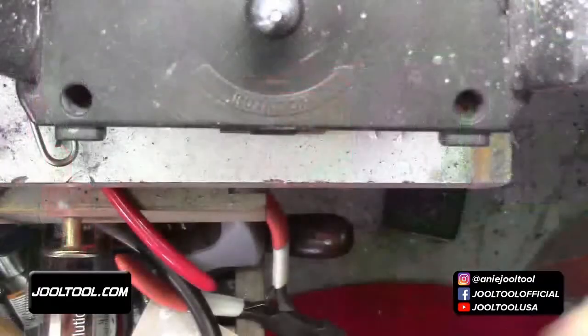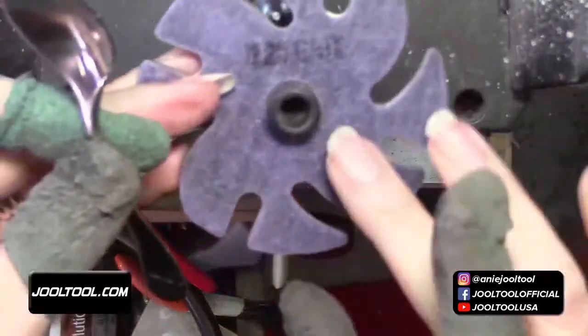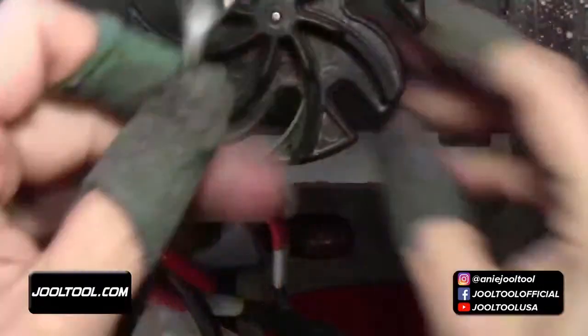So a beginner, to be safe, stick to the coarse scratch eraser. But I'm giving you a little tip. If there's an area where the pit is really deep and I just want to get rid of it, you can use your purple 120 grit lightly in the area, just like you saw me do. So I'm going to show you guys one more time, light area, and that's how you accomplish it with the purple. Let's show you the proper way to use the purple if you need to.